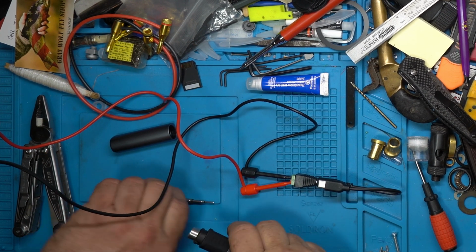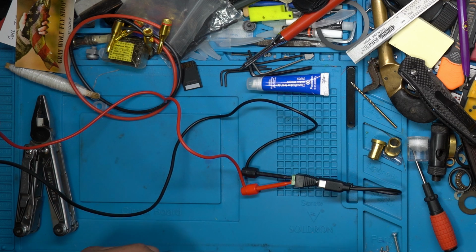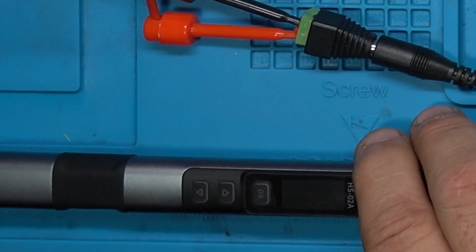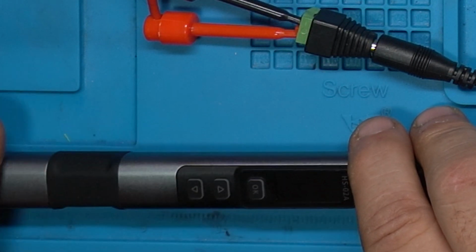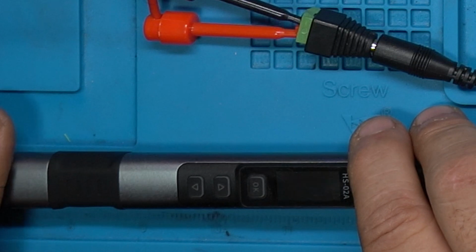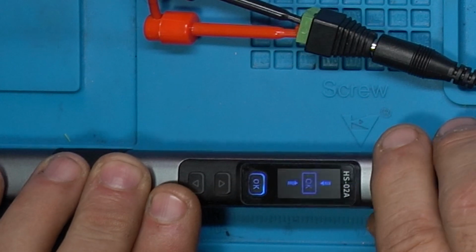Okay, so now we're ready. And this is going to be the final test, because I have it set at 2.05 amp on the supply, again at 20 volts, with a 3 amp overcurrent protection and no over voltage protection. I've got this thing upgraded and decked out, and it'll go 4 digits on current. I can get into microamps adjusting to find out where this is going to be restarting, but restarting at 2 amps, and if it'll fire up at 2.05 amps, that's good enough resolution for me. Has it fired up at 2.1 amps? So let's see what we can see.